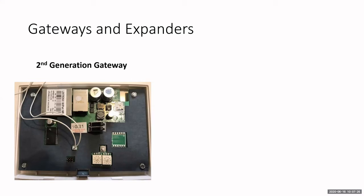That will wipe everything out of it, all of the locks that are assigned to it, all of your parameters, your static IP address, and everything that you've set is going to be wiped out, and it's going to be set back to factory default. A soft reset will just wipe out the locks. Okay, it will keep the IP address and all the parameters. So there's two different types of resets. So read the manual, and it'll show you how to do that.